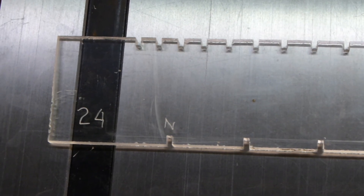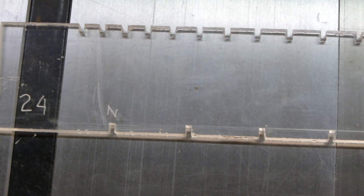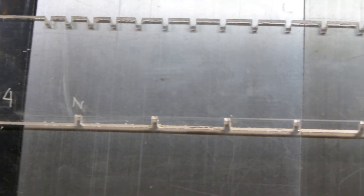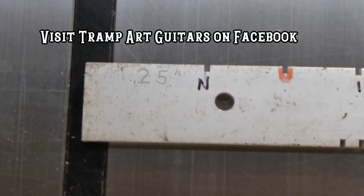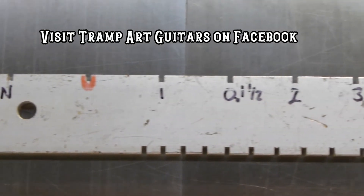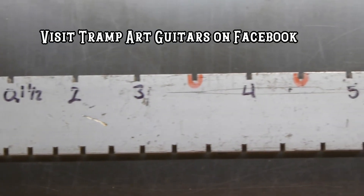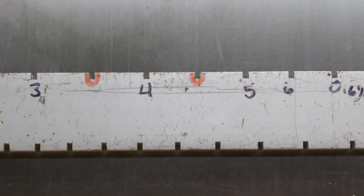There it is — that's all there is to it. Cut the slots, I've got it marked for 24-inch scale with the nut and then each fret corresponding. That's all there is. You don't have to do these in plexiglass only — you can also do them in aluminum, like I've done here, and it works just as well.